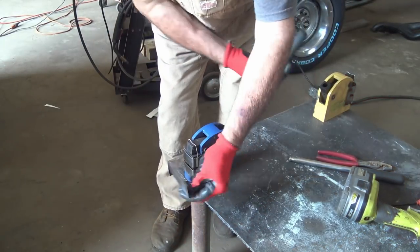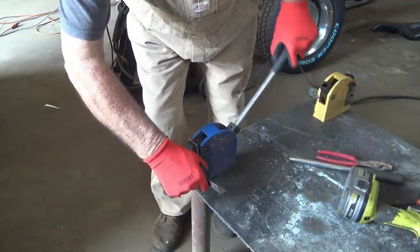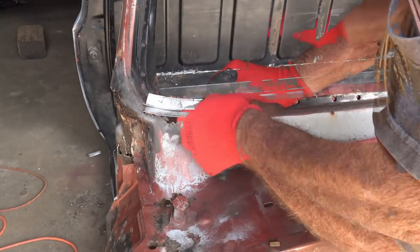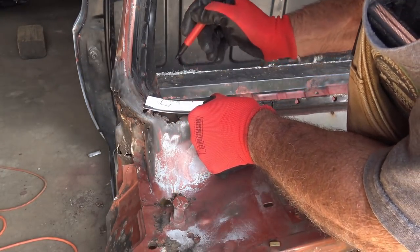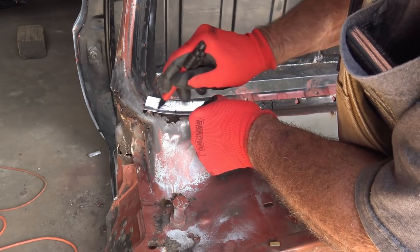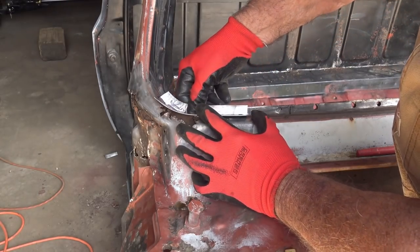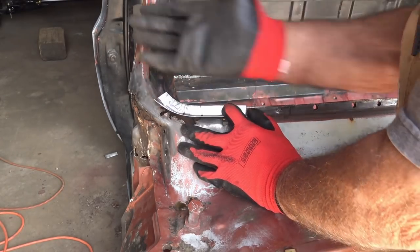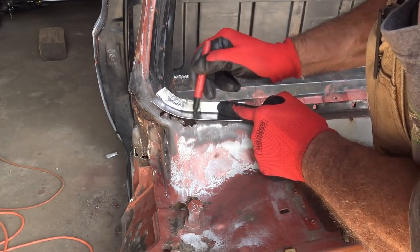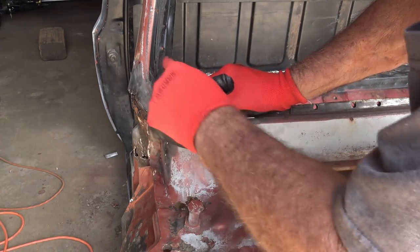You see just them two, see how much bend in just a little bit. It don't take much, that shrinker. Okay, you see I'm well on the way. I need to spend a lot of time shrinking, I would say, from here out. So you see after more shrinking, we're getting pretty close there. So now it needs to curve in this way, like from here out. So I'm gonna get the stretcher. I need to stretch this, sort of push it in.